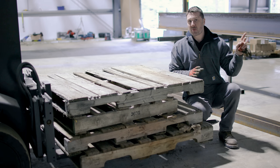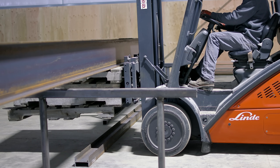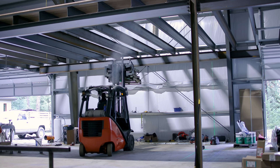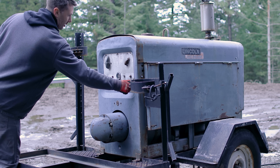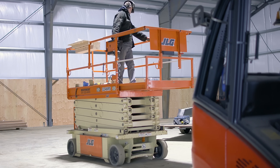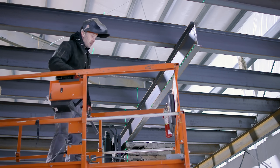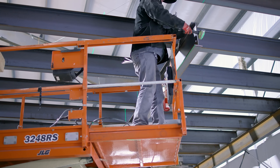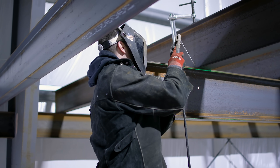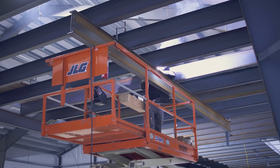The beam is ready to be installed. I'll put it on top of pallets and hang the beam first with some welds off the existing joist, then come back and stand the columns up. The welder I'm using is a Lincoln SA200 pipeliner with eighth-inch 7018 Lincoln Excalibur — my preferred method of welding because it's reliable, simple, and always works. I noticed the I-beam had a pretty good curve, which is typical, so I hooked a ratchet strap to one end and gave it a good tug to straighten it out.